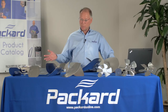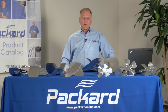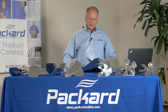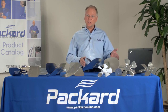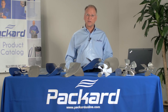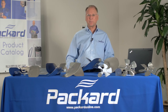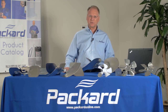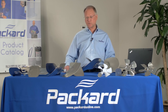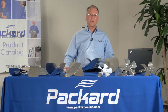When matching a fan blade to a motor, there are a couple of important considerations. First, the speed of the motor is important — if a fan blade is not designed to turn at the speed that the motor is rated for, it could cause the fan blade to fail, causing excessive flexing in the blade and causing it to fly apart. The horsepower is also a consideration. If the horsepower is too strong for a fan blade, a similar circumstance could occur where the strength of the blade may not be sufficient to handle that horsepower.